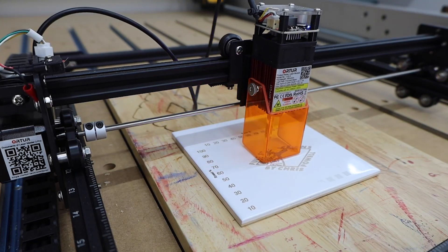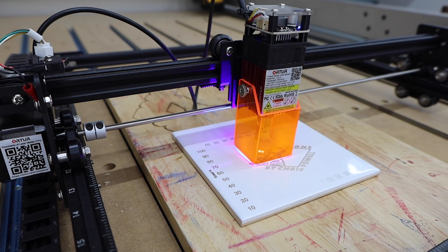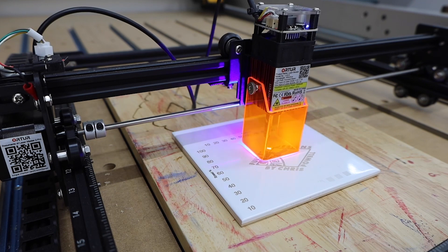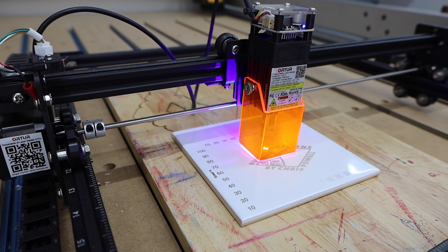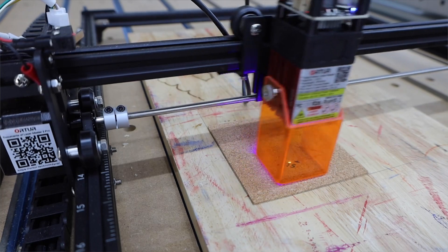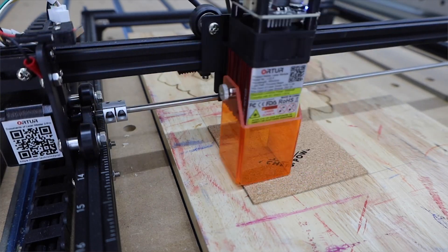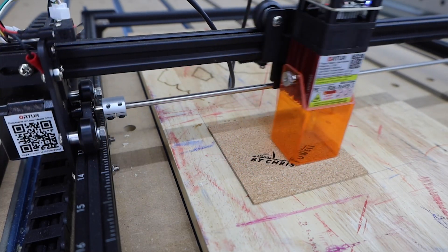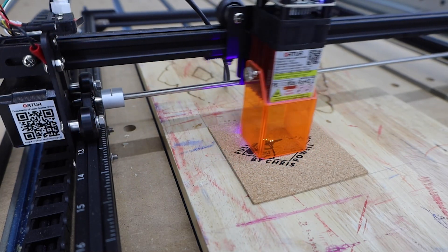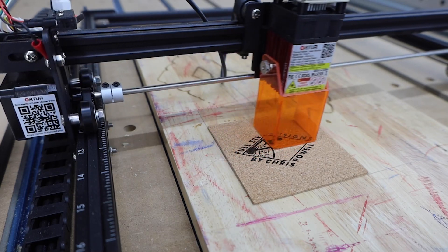Tile is a very popular thing to engrave. I'm still working to perfect the process, but here's one of the tests I've been running — it shows the effects of different feed rates and power settings. These are a great place to put portraits or logos for gifts. Speaking of coasters, cork is a great thing to put on the bottom of them, and that's a great place to put your logo. I was able to get a ton of cork blanks already cut to the size I wanted, but you can also use your laser to cut them out of a larger sheet. The ones I bought have a sticky back, so they're easy to apply.